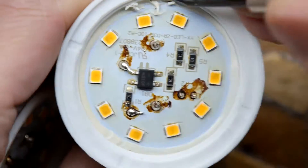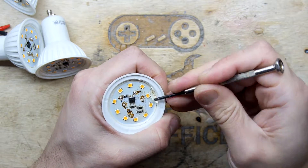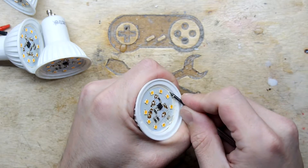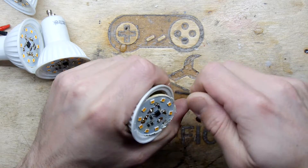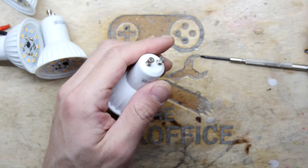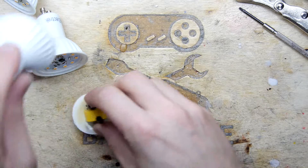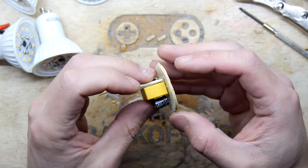Perhaps they've succumbed to some sort of environmental or electrical stress on the actual LEDs themselves. Without building a proper rig to hold this, I'm not really happy about trying to shove mains in. This is going to be my sacrificial one just to see how to open it up. They're held in as per usual, which you can normally just break off like that. And there's not much there, is there really? Just a capacitor — actually, two capacitors.